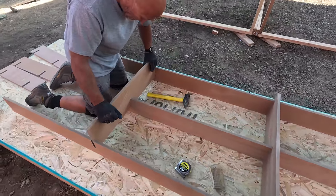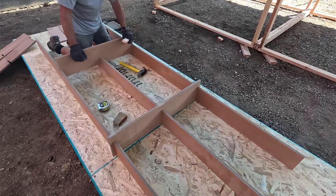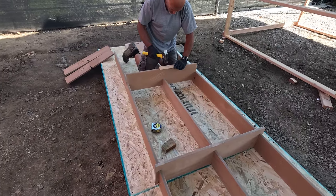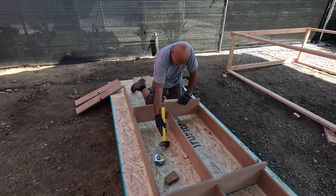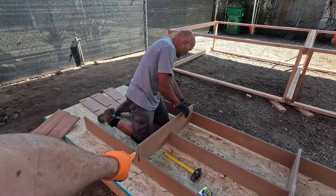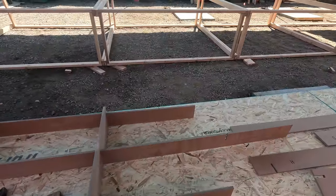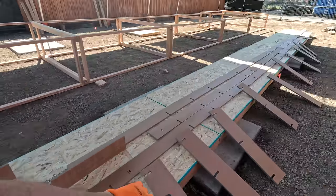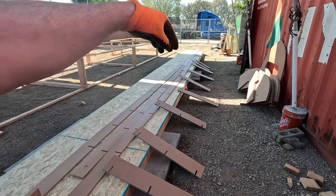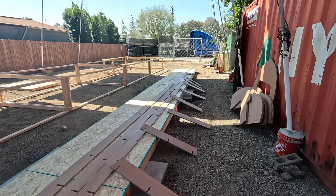When putting these ribs in they're very tight and we had to hammer them down to get them in — they're very snug. It's difficult but you just take a piece of wood or a rubber mallet and slowly work them down. It takes a lot of force to get those down. That piece — BF17 — doesn't have extensions; it just has two tiny little slots in it and tucks in on the inside. At this point we're going to start hammering in all of these different cross pieces. They're all marked BF19 through about 4; then the pieces get so small that you actually use the ribs to stick up as the inserts.